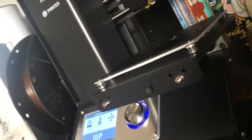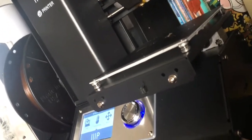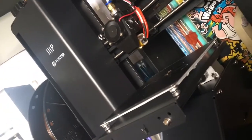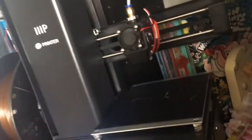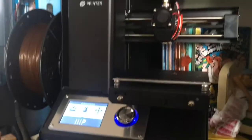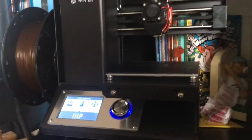I'm probably harping on a printer that only costs this much money, but seriously, why aren't they using a NEMA 17 for the Z-axis? That tells you it's a Malyan clone — I have a Malyan M100 right there and it uses the little DC motor for the Z-axis. I guess if you're going to put a DC motor on an axis it'd be the Z, but still, it makes pretty bad layer lines. The first upgrade I'm going to do is change it to a NEMA 17 motor — I have a couple of them.